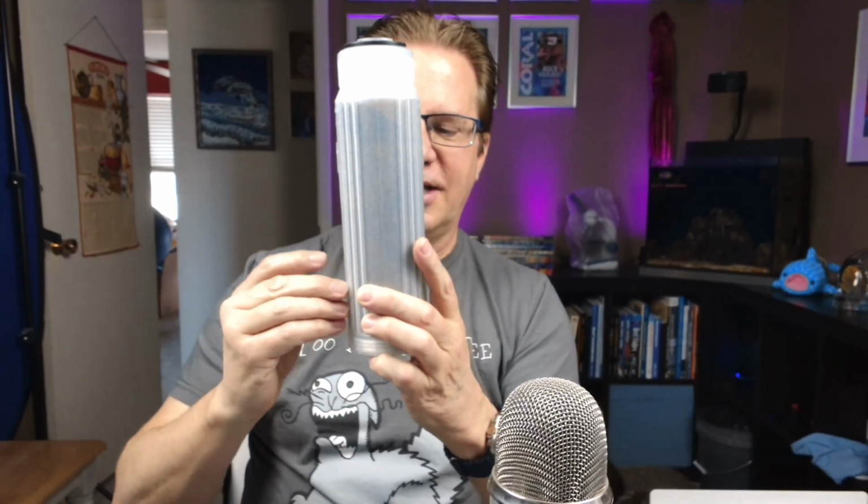So my DI cartridge was all orange. It wasn't like this. This is how they look when you buy them, but then when you get them wet, they turn dark blue or black. And then over time, the bottom will become orange, and the orange will rise and rise and rise. It's just a visual indicator. It does not tell you how much TDS you're getting. It does not tell you much of anything other than you're consuming the resin. So my resin's orange to the top, but it's coming out 0.